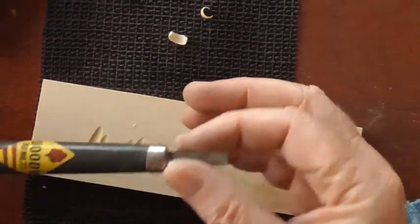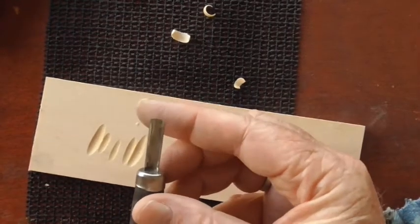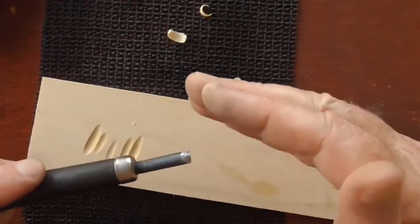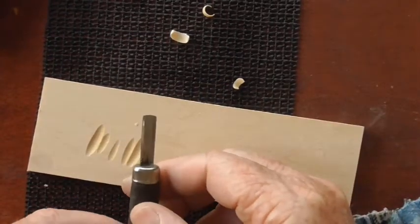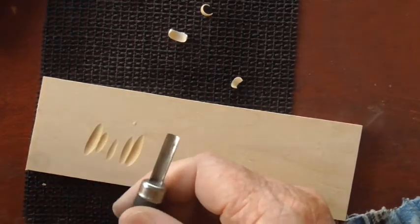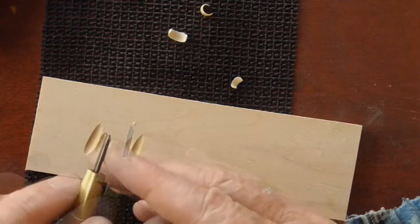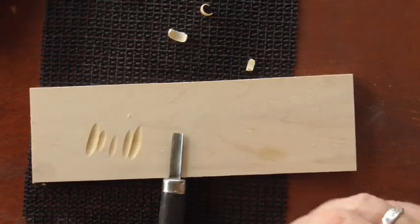We're going to use the same stages and technique to keep the gouge profile correct and the angle of this bevel correct, as well as keeping the bevel itself very flat as it's evenly around this curve. It takes some time and skill to do a really good job. It's definitely easier on a slightly bigger gouge. A very fine one is quite difficult to do, particularly to maintain the profile as a very even shape. That's sharpening a gouge.